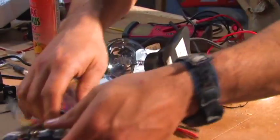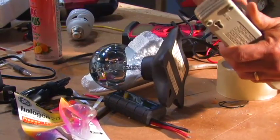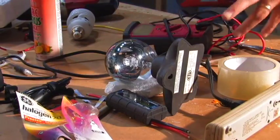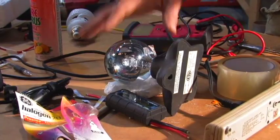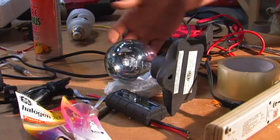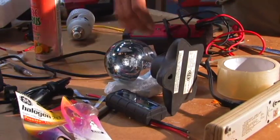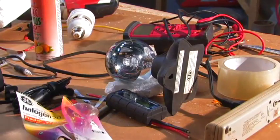I'm going to plug this directly into our power strip, so we're running an AC bulb on AC from the alternator. You don't have to be perfect — these are filaments, so they are a resistive load and can handle different voltages. If you hook something like a motor to this at low voltage you can burn the motor up, so don't hook anything but resistive loads like water heater elements. As long as you don't go above their wattage, you should be fine.